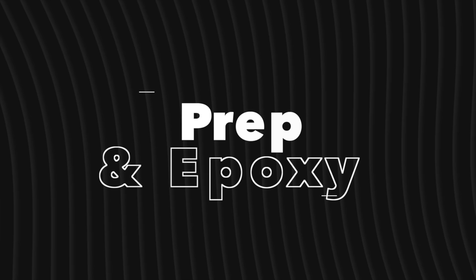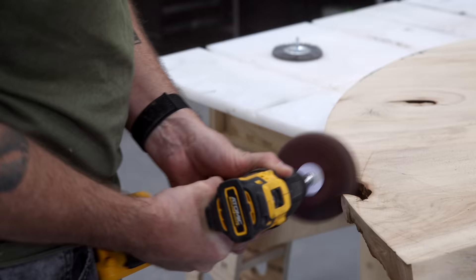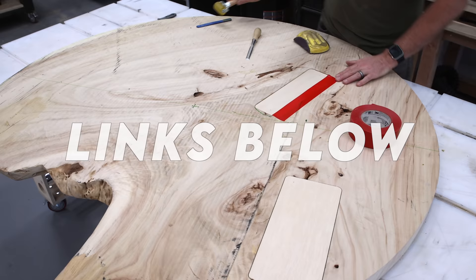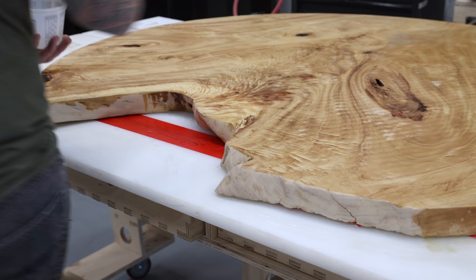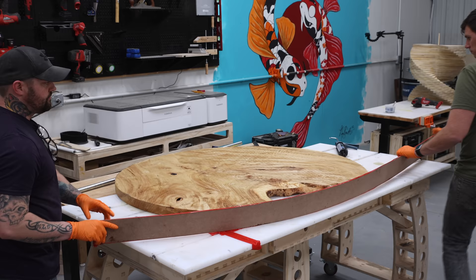I power carved that exposed edge and now I'm coming back through with nylon wheels to clean everything up of any gunk or bark residue. I also really like using a flap sanding wheel. Getting prepped for the epoxy pours — I'll be using Total Boat Thick Set Fathom, a three-quarter-inch deep pour. Before pouring, I taped everything off and sealed the slab with Total Boat Gleam Varnish to help prevent the epoxy from staining the wood. Then I covered the leading live edge with high-performance epoxy to seal it, preventing air from the slab leaching out into the epoxy while it cures.